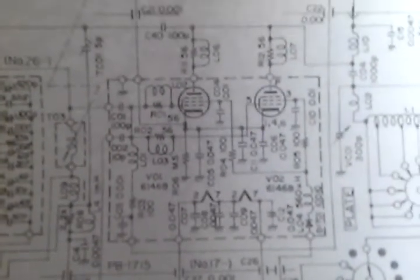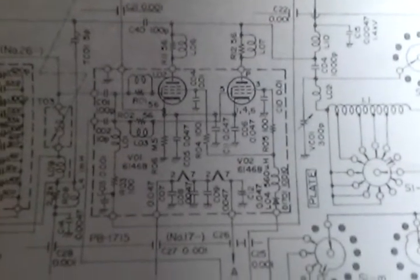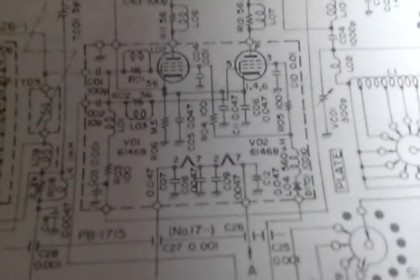I checked the inductance with my LCR meter — it's fine. I changed all the capacitors, and they are proper spec and brand new, as some have pointed out might be the problem. It's not a leaky capacitor or an off-value capacitor — that's not the problem. So if you all could give me some ideas of what you think is going on and what is causing this resonance, I would appreciate it. This also might answer why, when the tubes are pulled even when they're cold, the ALC calms down — because the grids do offer a certain amount of capacitance.